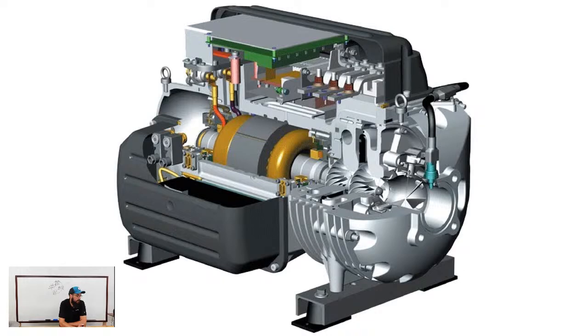How do turbo core units compare? Turbo cores themselves are beyond efficient. I mean, stupid levels of efficiency for a compressor. It's pretty incredible. The turbo core is oilless. If you hear the term mag bearing passed around, there is no oil in that system. You can't have oil in that. Daikin is the best. I like what Daikin's doing too. I really do. I think Daikin has some really incredible machines coming into the market.